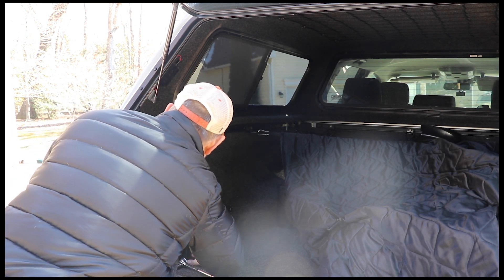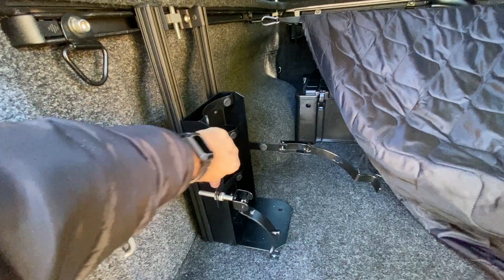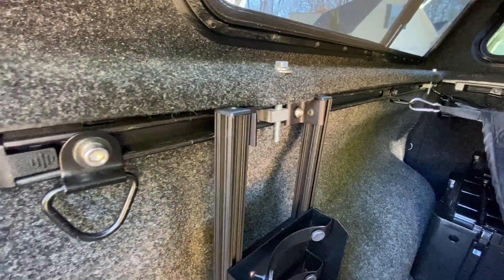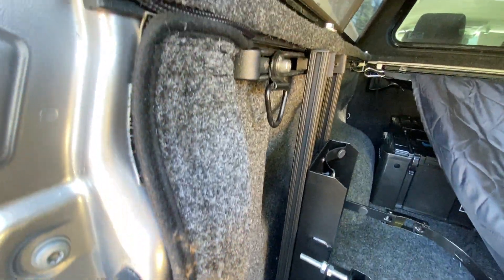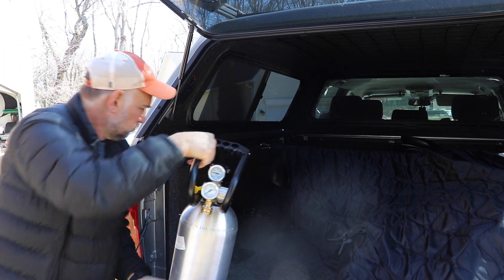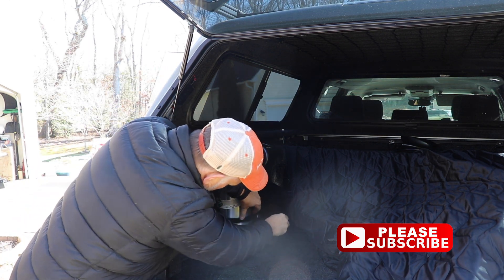You bolt it on easily and it's very strong. This idea just came to me in my head — I drew it up, sketched some pictures, and said I'm gonna try it. It ended up working out just fine. Here it is all bolted in. You can see the T-nuts slid into the bed rails, bolted right up to the inside corner brackets. The 15-series uses big Allen bolts — I also used a split washer to keep it super tight. It turned out really strong.